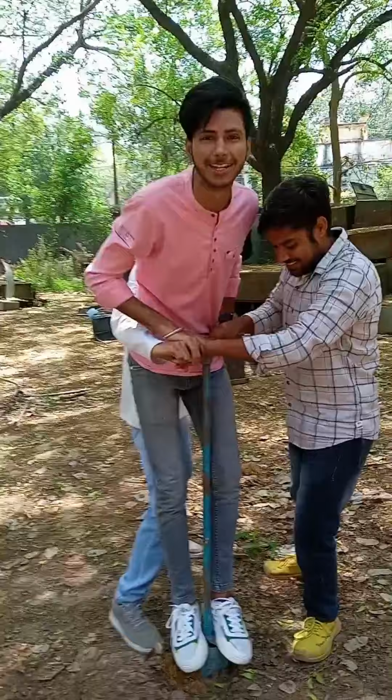Safety and equipment. Before you begin, you'll need an auger, which is a spiral-shaped drill bit attached to a long metal rod. You'll also need a sturdy frame to support the auger, and a power source to rotate the auger. It's important to wear personal protective equipment, such as safety glasses, gloves, and steel-toed boots, when operating an auger. You should also make sure the area around the boring site is clear of any obstructions, and that you're not working near any underground utilities or structures.